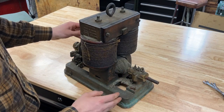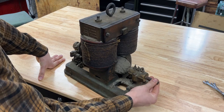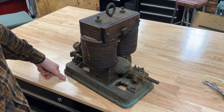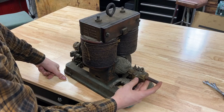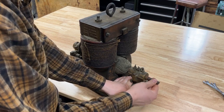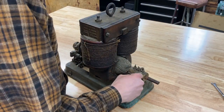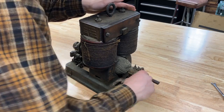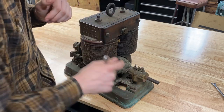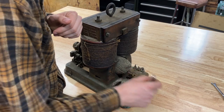Mechanically speaking everything's free — the lever with the brush holder is not seized. The center spins just fine although the brushes don't engage fully because there's so much old oil and dust in there. There is about a sixteenth of an inch end play, and if I hold it down there's barely any radial wear of the bearings, though there is some I can feel. I figure I might as well open it up and inspect the bearings. I'll be very gentle — don't want to wreck anything — and I'll hit the rest of the surface with extremely fine steel wool and possibly a bit of oil.